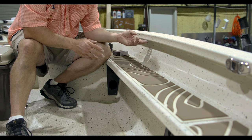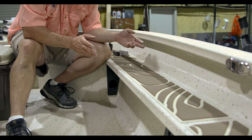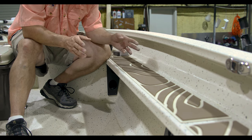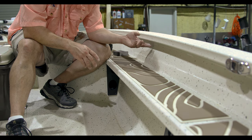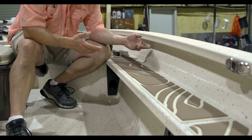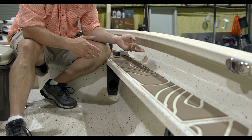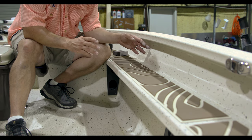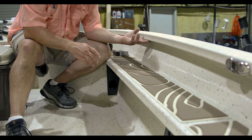One thing important on these snake tubes to never forget, it's about a 72 hour curing process. It's not saying you can't touch it for 72 hours, but you don't wanna stick them on and then leave it and never come back to it. Within that 72 hours, we suggest periodically, depending on where your boat is, if it's sitting out in the hot sun, it's gonna take more time, to come by and repress all those on. If you just stick them on one time and leave them, there is a good chance that they could possibly unadhere from what you stuck them to.